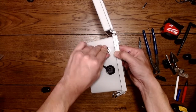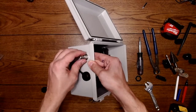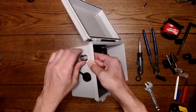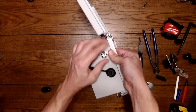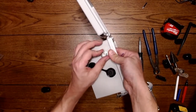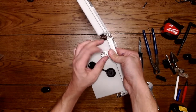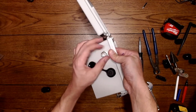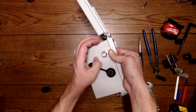These are a little bit tougher threads because they have that cut on the side, so you want to make sure that they go down without any resistance. If you meet resistance, back it out and start again. Something's wrong. That's cross-threading. So I'm just trying to get this to go down as smoothly as possible. You don't want to force this. You should just thread in like that.